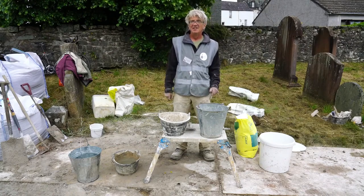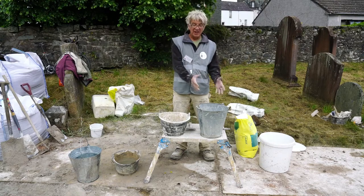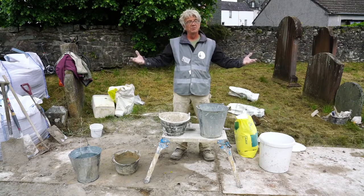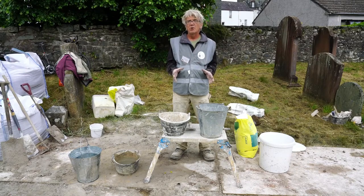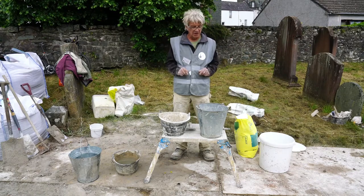If you were lucky. When you do it with a hot lime wash and then add the aggregates, they remain in suspension for way beyond the time that you need to actually apply it. So these are things that are telling us what we were doing probably wasn't what they did. Not that they often used shelter coats as such.